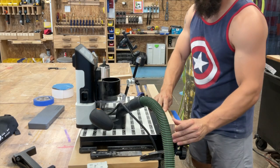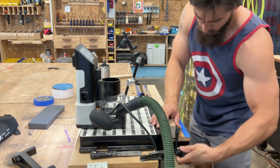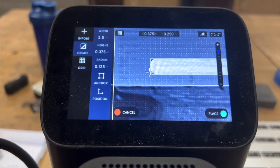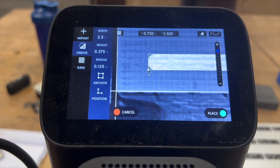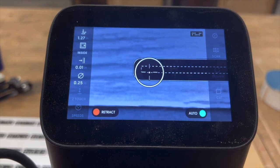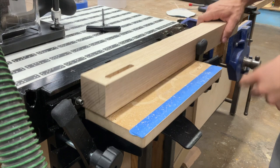I'm going to prep to cut all of my mortises by switching to the horizontal work surface, still using the clamps to keep it in place. I'll make the exact same shape I just did and place it in the appropriate location: three-quarters of an inch down, three-eighths of an inch up, so I have a slight shoulder on the inside of my leg. Then I'll cut my mortises — super simple process, same as cutting the tenons, actually a little easier because I don't have to cut the shoulders.